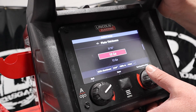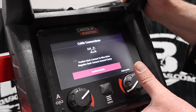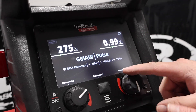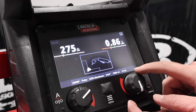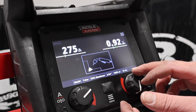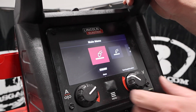It goes up to half-inch down to 16-gauge. I have 10-gauge, which is 1/8-inch material. We checked our polarity and we're good to go. It gives us a recommended setting — arc length is what we're measuring now, and then our wire feed speed. It shows us in the green, and it shows us with the arc effects what our bead appearance does when welding. That's the ready, set, weld function with arc effects — it tells us what adjusting wire arc length does to bead appearance.